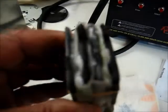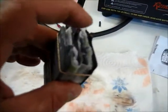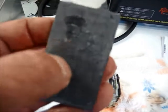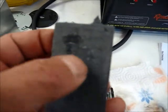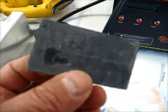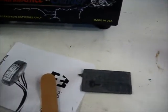When I get done pasting this, I'm going to bridge these together with lead and create this cell. This will have double the current of the other cell once it's formed. Remember, the sulfation is on the plate, and even though you think you get it off, you don't. This is going to combine with the plate as it moves the alum chemical back and forth, which will neutralize what's on the plate. You can look for a pH level above 3 because of the way the alum is being mixed.